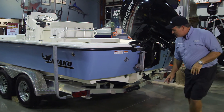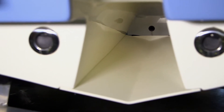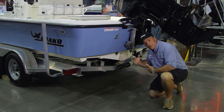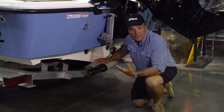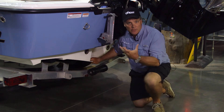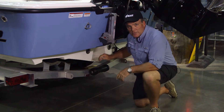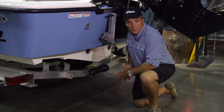Number one, you'll notice it starts out with a tunnel — a tunnel built into the back of the boat that goes about three and a half to four feet forward on the 21. It has a plate at the bottom of it that goes almost to the front of the tunnel, stopping about six inches short. The combination of the tunnel and the plate with a little space at the very beginning gives us another unique feature: when you throttle this boat up at speed, the tunnel drains of all water, allowing air to be introduced into the water column directly in front of the propeller.